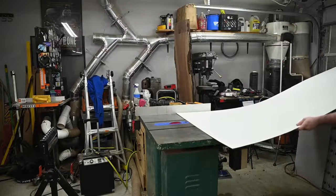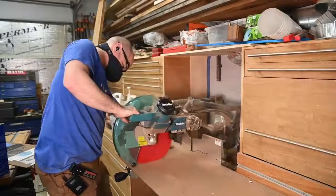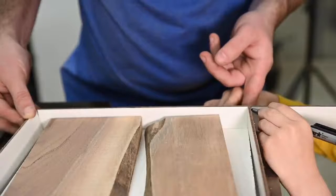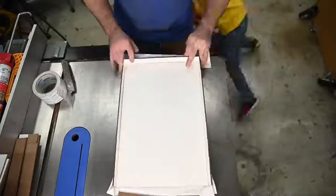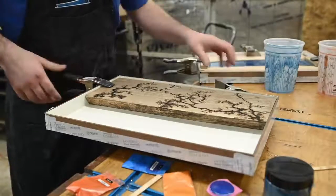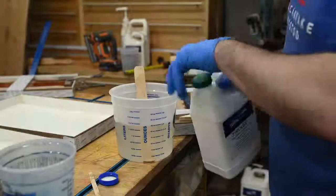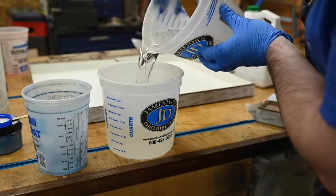The walnut boards are a bit different — they're going to be half epoxy, so they do need a full form built. I experimented in a previous video and found that marker board actually works fine as a mold, so I break it down to have a bottom slightly larger than the finished boards I want, and some thin strips for sides. Those all get cut to fit the base, and keeping with the idea of these being quick and cheap, I assemble it with tape and then silicone the corners to make it watertight. Then the boards get clamped into the mold in a feeble attempt to keep them from floating — in reality that would take a couple more clamps, but now I know that. For details on building larger molds, check out my epoxy coffee table build. Then I mix up a much larger batch of TotalBoat ThickSet for these bigger pours.